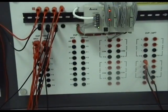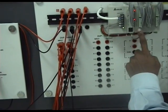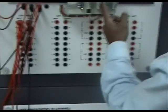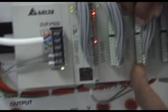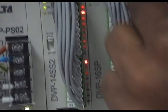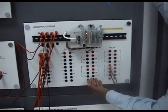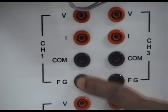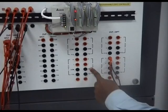We start with experiment 5. This is the DVP-14SS2 base module. We have an additional DVP-16 module for extension of digital I/O. Next to that is the module we are most interested in — DVP-04AD, the analog module. These connections have been brought out here. Like I explained on the whiteboard, this is V+, I+, common for channel 1. Channel 2, channel 3, and channel 4 are also available — this can handle 4 channels of analog information.